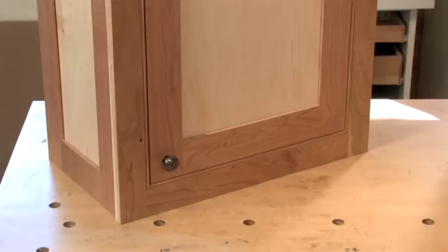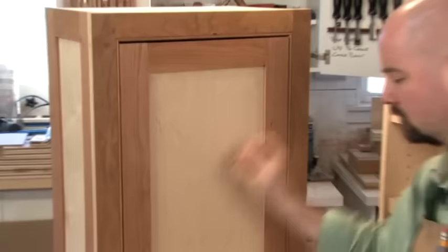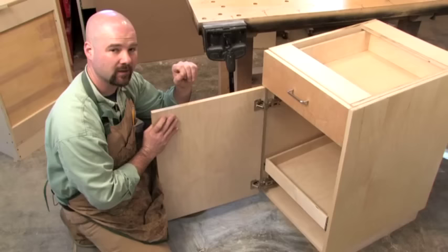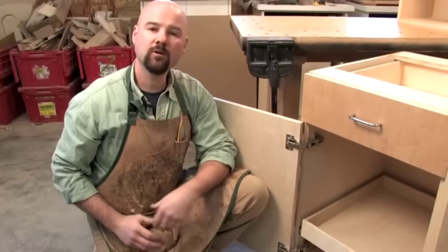There are two basic types of cabinets: European and traditional. Traditional cabinetry is often called face frame cabinetry because the boxes are dressed up with a face frame applied to the front of the carcass, adding a distinctive border and style. European cabinetry — or Euro cabs or frameless cabs — don't have that face frame and can provide a sleeker, more contemporary look. European cabs have a slight advantage in spatial efficiency since there's no face frame taking up room, and saving a few extra cubic inches per cabinet can yield as much storage as a whole extra refrigerator.